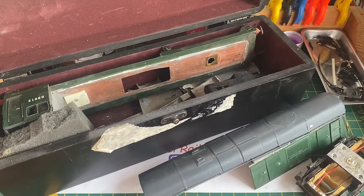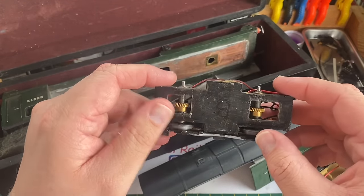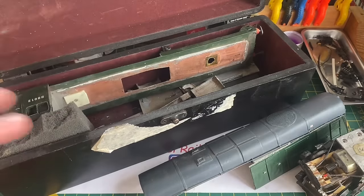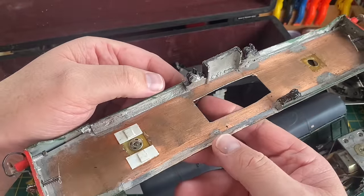I'm going to reassemble this with two-part epoxy resin. I know there'll be people saying you should solder it, but I don't want to ruin the resin parts. I've never soldered white metal before, and the new two-part epoxy resins you can buy are absolutely superb. I'm going to be using Gorilla Glue brand. There's the motor, two axles with wheels off, and one of the frames — these are all resin. I've got no idea what make of kit this is, so if anybody knows, do let me know. There is the chassis, which is brass.